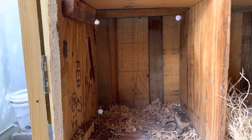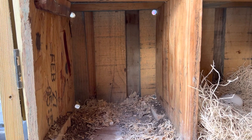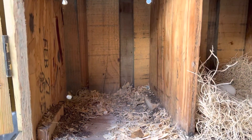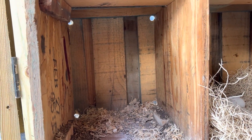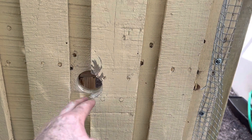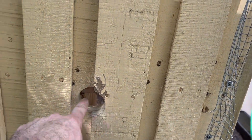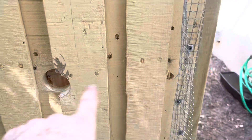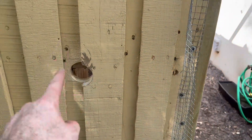So you can see here I've got our corners drilled out. Now I can get my sawzall and just go ahead and cut out the whole back here, and then we'll work on getting our automated door put into that spot. I can't get the saw blade in here for the sawzall, so I'm cutting out larger holes with the hole saw on the drill. We'll just do that here and then come across and go down with the sawzall.